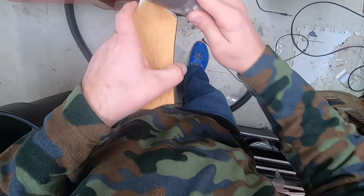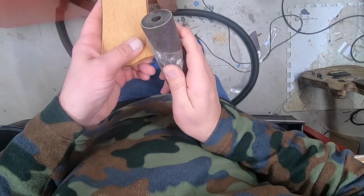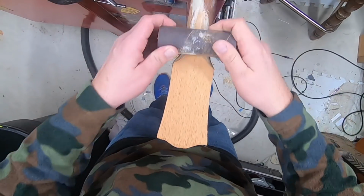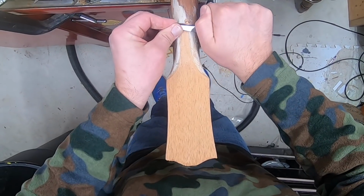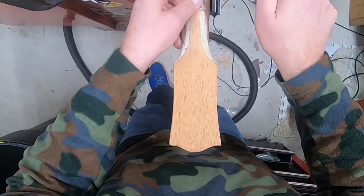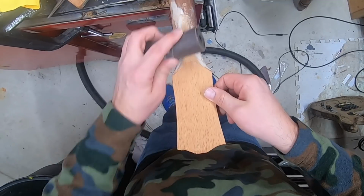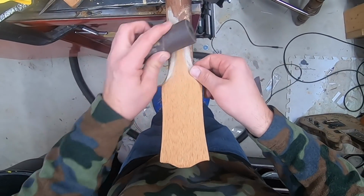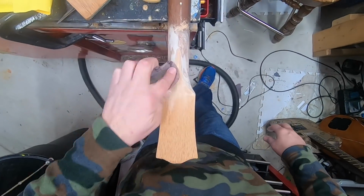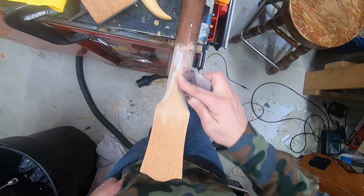And then I just sanded this down with, I think this is a 120 grit piece of sandpaper on one of the rigid sanding spindles, and just sort of fine tune it a little bit. I know you lose the color of the wings, but it's the best I can do. I will throw this in the light box in a separate video to show how I darken this up and get the wood to match a little bit better. But here is the final fix at this stage.